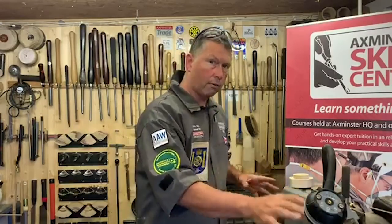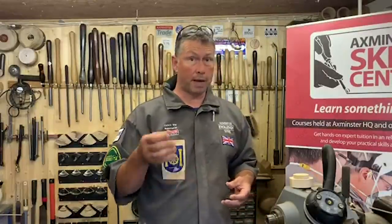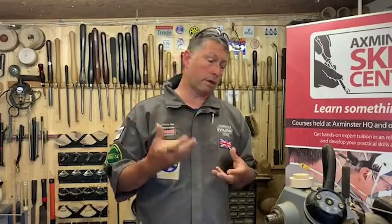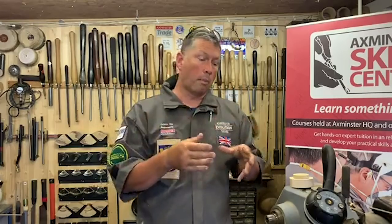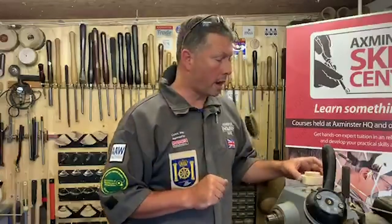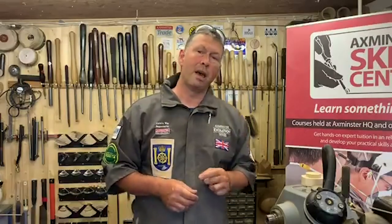The usual thing when it comes to safety: we're going to try to start at zero RPM whenever we meet fresh work. The dust extractor is here and ready. I'm not wearing a dust mask so you can hear what I'm saying — that's the only reason. When there's no cameras on me I have a full face dust mask on. I am wearing goggles. If it were a bigger piece I would be wearing a full face shield. Never underestimate what can happen — don't go onto the lathe without eye protection. It will catch you.